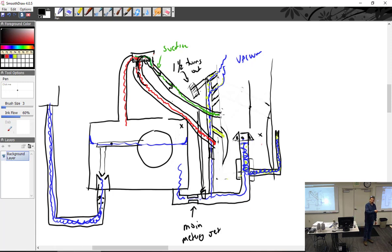Guess what? You back out the mixture to set the mixture, and what did it just do to your idle speed? It changed it. It went up because you went closer to best power. It was so rich that it was running slow. Now as you back the idle mixture out, it goes toward best power. So now you're pulling back on the throttle trying to slow it down. You set it at 550, but now it's up at 750 because the mixture is getting better. See why you have to do the mixture first? Yes. Get the idle out of the way. Get rid of the stop screw. That's all I'm saying.